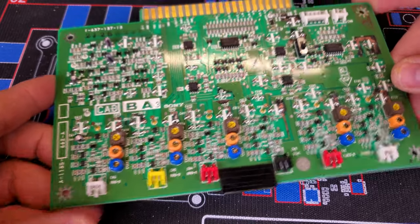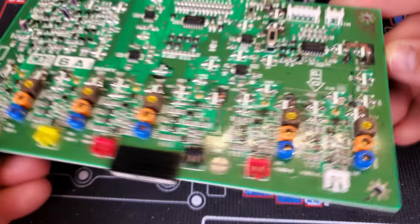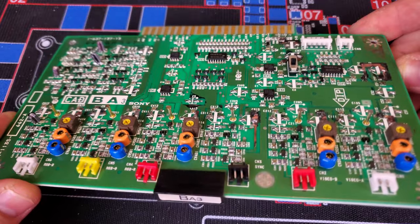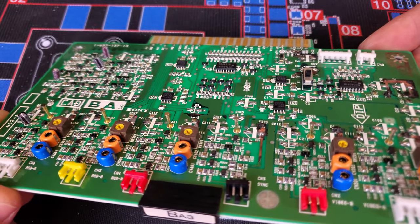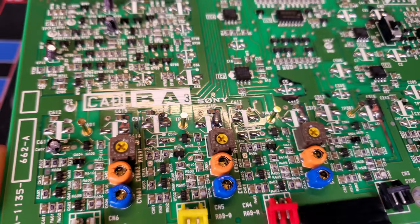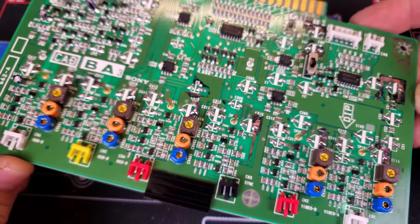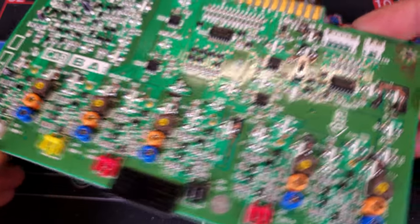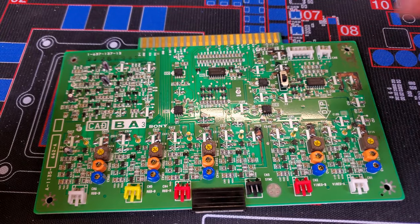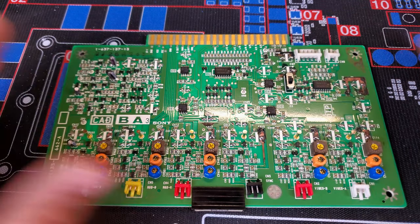This card will be serviced to the point where it'll be as good as possible. If you want to follow along with the rest of this repair, please check back in — that's probably going to end it for today's session. We'll go in and recap this in the next video on the actual restoration. That's how you get those capacitors off the pads — just pull them, then clean everything up and get the board into this condition where you're ready for new capacitors. Thanks for watching everybody, I'll see you next time with some more retro content.